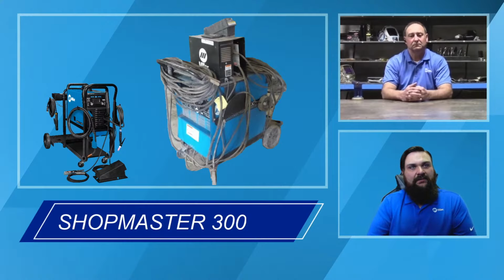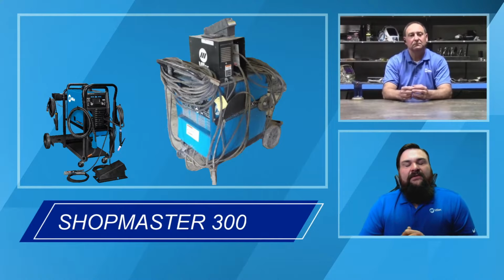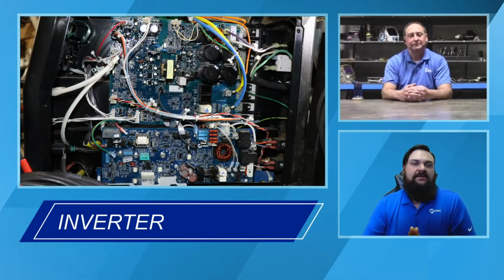Where on these newer style machines, we're going to an inverter base. A lot of what is heard today, even in the home consumer market, is going to inverters. And the big difference is what is this machine truly controlled by? Again, on these older transformer style machines, that was going to be a piece of copper. On these newer inverter machines, what we're referring to is truly the internals of the machine are an inverter-based PC that controls that output power. So we're no longer limited to the 60 hertz power that we got coming out of the wall, being able to modify it slightly with some magnetics, and then having an output that's okay for some processes, great for some, and you try to combine them, a lot of them end up being just okay all the way around.